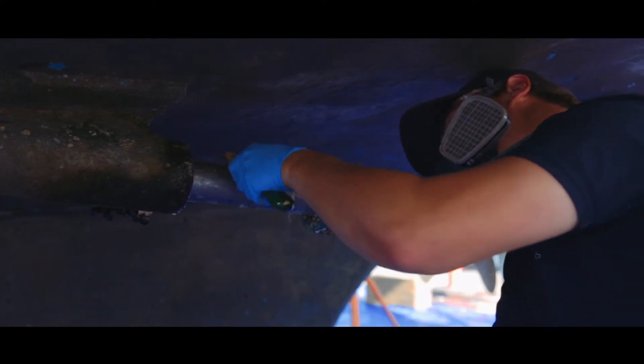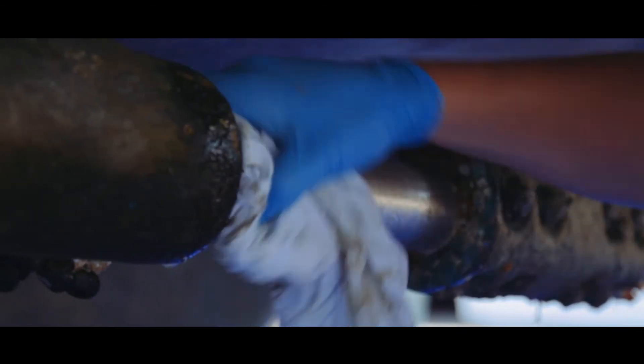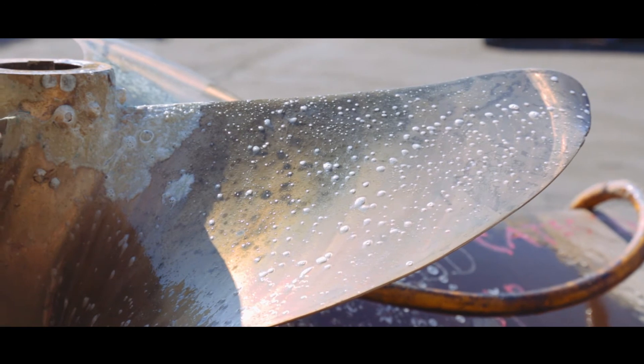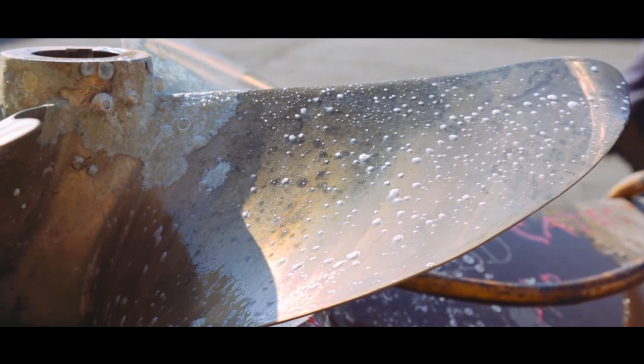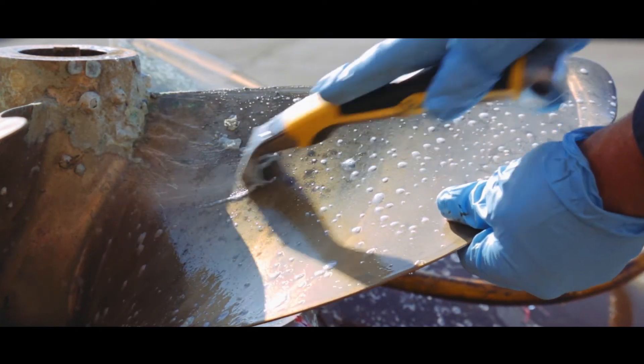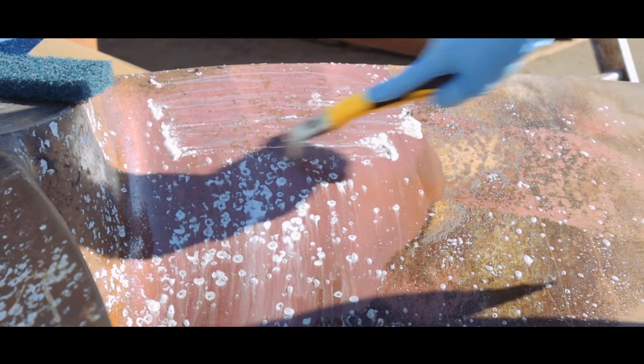The directions are very simple to follow — it just scrapes off nice and easy. I like to spray the product onto the barnacles first and let it sit; the propellers can be wet or dry, it doesn't matter. Spray it on, let it sit for a few minutes, then use a regular paint scraper like you'd buy at Home Depot and work underneath the barnacles — they pop right off really easily.